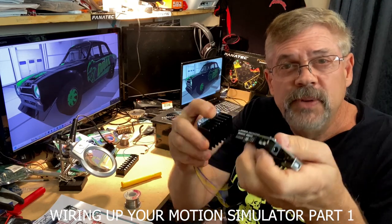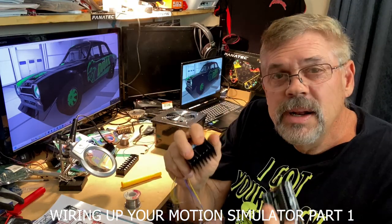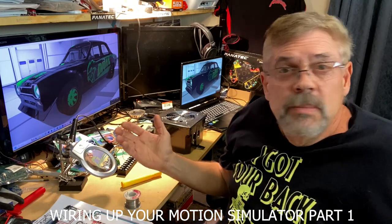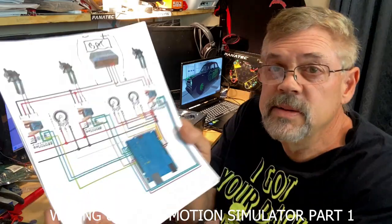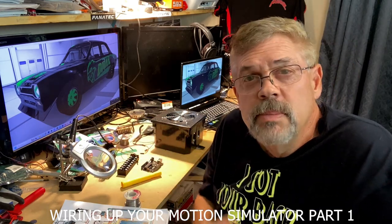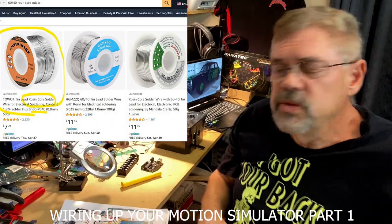Now, if you do the soldering, there is a chance you could screw it up — you could overheat one of these things and ruin the chip. So you've got to be careful. But as long as you just heat it up enough to get the solder going and follow my steps, you'll probably be fine. I have a lot of IBTs and a lot of Arduinos — I've never messed up one of them. But there is a possibility you could, so just beware. I'm going to show you how to solder it, but you can use the diagram to use those pin connectors too. What I'm going to be using is 60-40 rosin core solder — you can get that on Amazon. I'm trying to put a link to all these different things in the description.